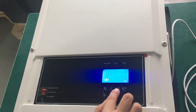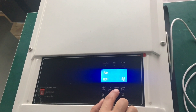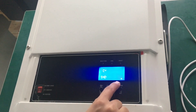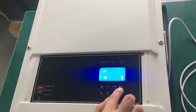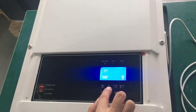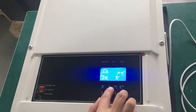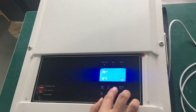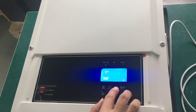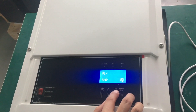We will change the charging and discharging cutoff. The charging voltage settings are in parameter 19 — you can set it as 56 volts, which we have tested from the factory. It's a very optimized charging voltage. The float charging voltage in Group 20 can also be set as 56 volts.